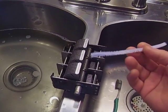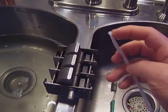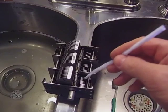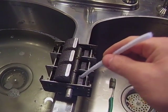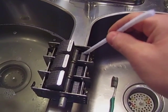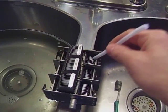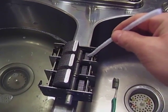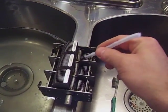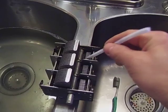This is pretty nice. You want to make sure that the metal stem inside of this isn't getting bent, because that way it digs into the side of your capacitor plate — that just spells disaster. Just be careful and take your time cleaning your tuner. This is a vital part of your radio. Why would you go through the restoration of everything else and then scrimp on cleaning something as important as your tuner? So I've just been going through here real easy and gentle, fitting it down in all these little crevices. Works pretty good.